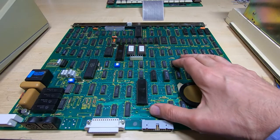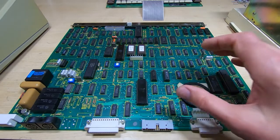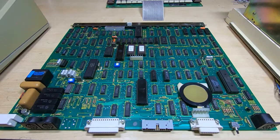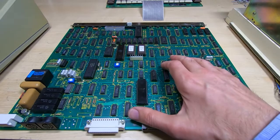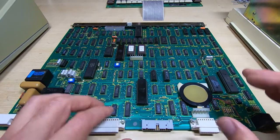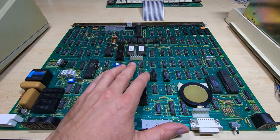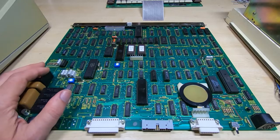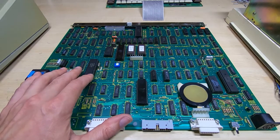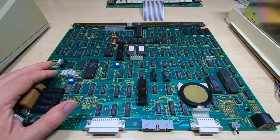This is actually a third machine I have here for repair. The actual machine itself is in extremely good cosmetic condition — it doesn't belong to me, it's somebody else's. The board itself is in reasonable condition; not much has been done to it from the user perspective, but there is the usual damage on this side due to the battery leaking. There are a lot of failed components on this board. I repaired the power supply, powered it up, and it doesn't do anything at all. We've got the usual scan lines on the CRT — it lights up with the raster showing but nothing else. The rest of the machine seems fairly dead.